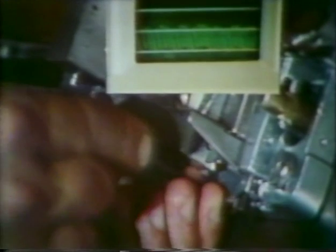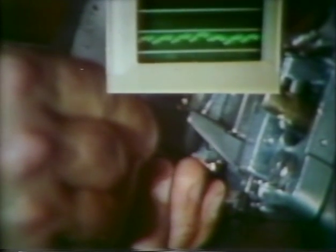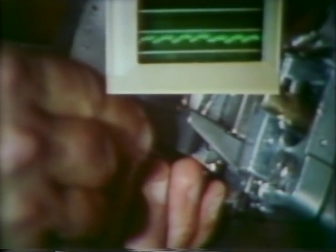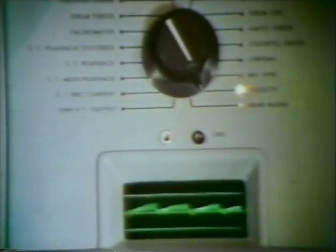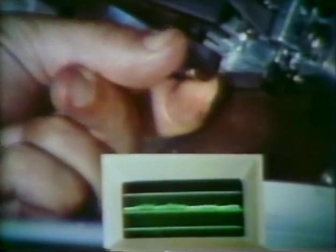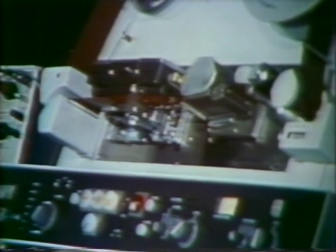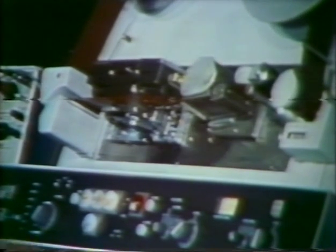This may also be checked by observing AMTEC error on the A-scope and adjusting to minimize. Either velocity error or AMTEC error A-scope positions may also be used to observe guide height or scalloping error, which is corrected by adjusting the guide height screw on the front of the video head vacuum guide. When tip penetration and guide height have been correctly adjusted, stop the recorder.